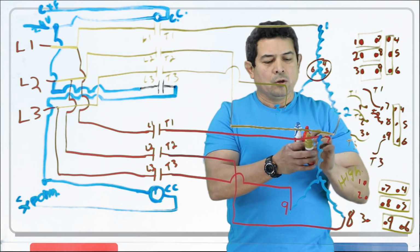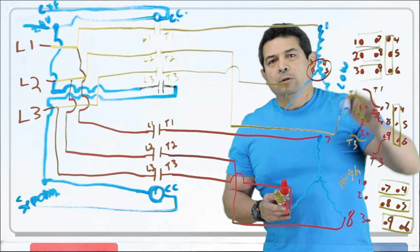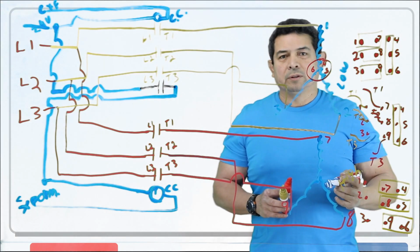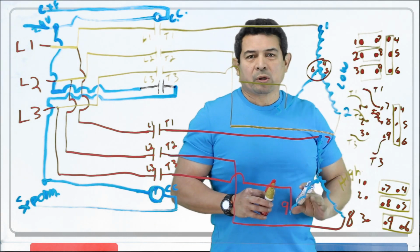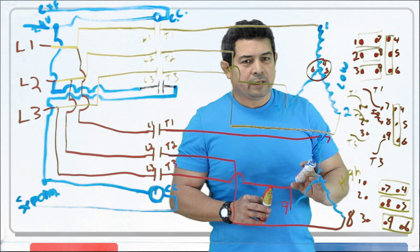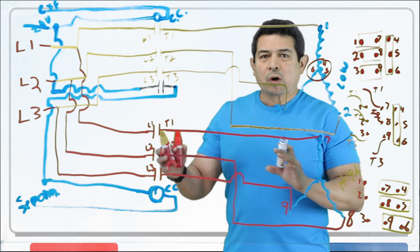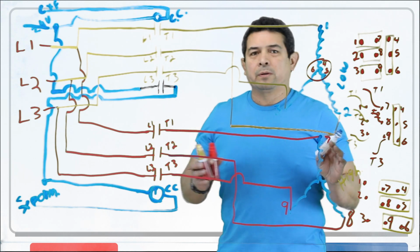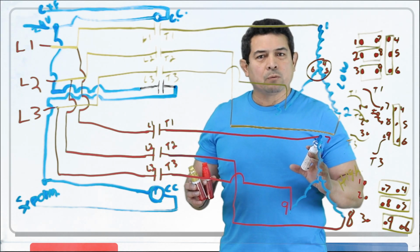And these here would be for your low voltage. Both of these would be for low voltage. You can wire them up either way, straight across the line, or 2-part start. Now there's a lot to talk about on 3-phase motors, and whether you talk about a compressor or a fan motor or whatever, it's all the same. But this is basically how you would wire it.